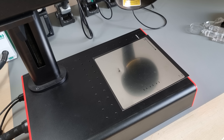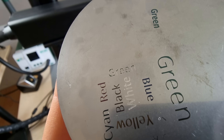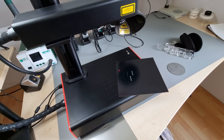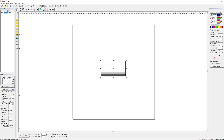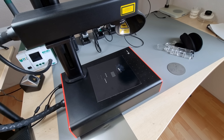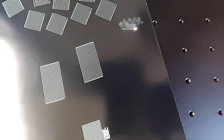While using fast scan speeds and only single passes, I got some streaking or even incompletely filled shapes. That seems to be caused by a setting called start TC microseconds. This time constant is a representation of mirror inertia — if we started lasing and moving a mirror at exactly the same time, we'd get overexposure and burning at the start of each movement, where a mirror is still in its acceleration phase between standstill and its programmed velocity. I'm giving the manufacturer a pass for not delivering these time constants perfectly fine-tuned from the factory, because they are scan speed, material, and job dependent. One can test these numbers by printing grids and fine-tuning them until there are no more gaps or overshoots. Getting the EM Smart MOPA up and blazing is pretty easy, but finding perfectly balanced settings for a given material takes time and intimate familiarity with the control software.